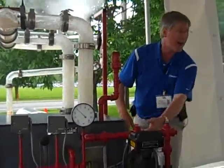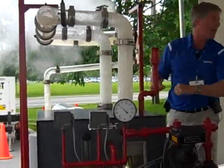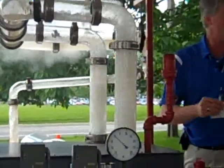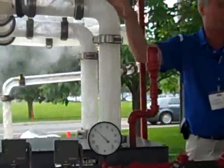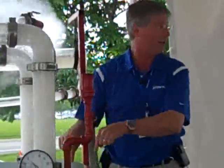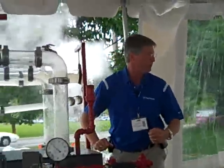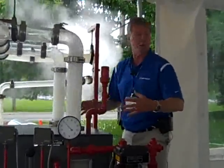As things become more and more violent, you get more and more velocity carrying that stuff out. Even though you want to size the headers correctly and size the risers correctly, you're now going to be dumping out wet steam. You want dry steam from your system. When you start slugging this stuff out of your system — and remember, guys, you can't see this — this is what's happening. All that oil you put in there at 7 o'clock at night when you flip the switch — all this crud is being injected out into your radiators. And you wonder why the vents are spitting, the radiator's hammering, and you have all these issues and problems.